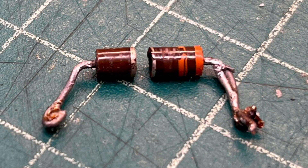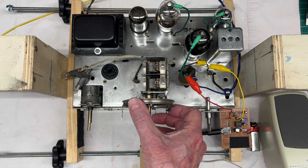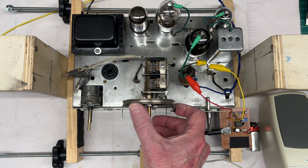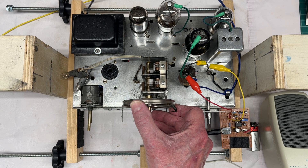Just one of the things I found: the wrong resistor in place, and you can see it's broken in half. Using my little LC front end AM broadcast tester here just to make sure I've got the antenna coil and tuning condenser hooked up correctly — and everything appears to be working correctly.